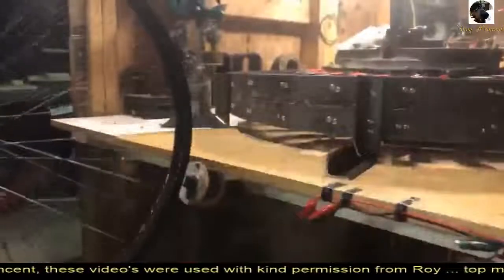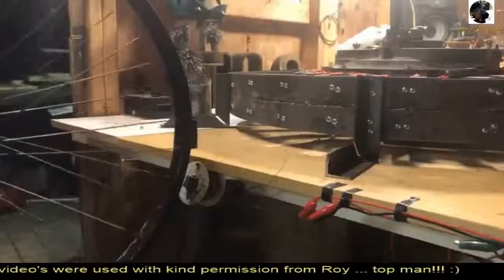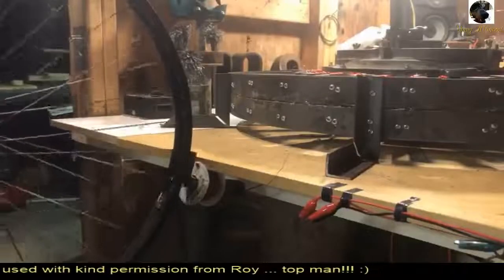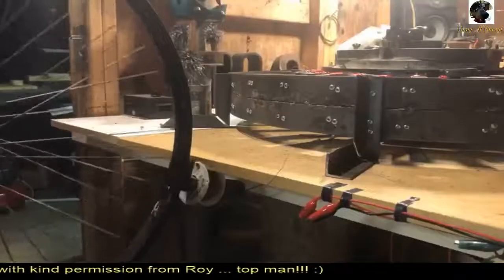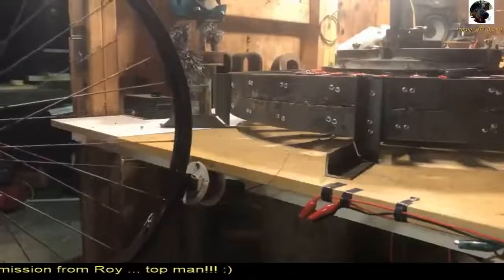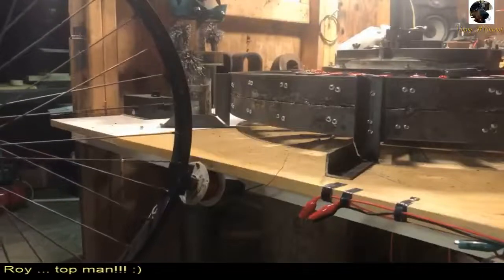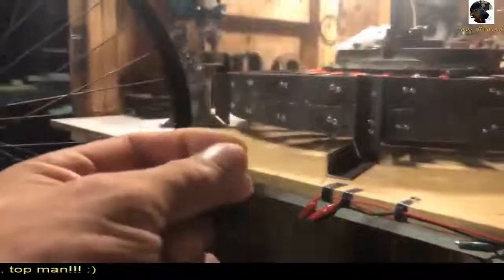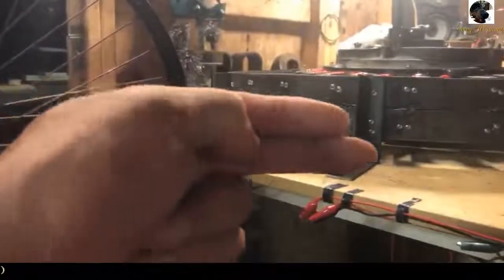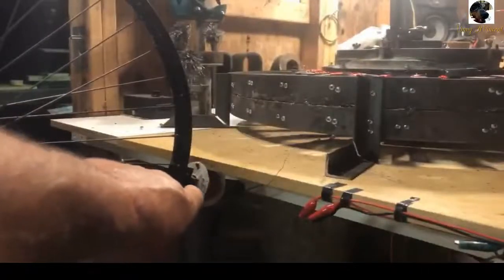That separation is creating the current that goes into the transistor, therefore turns on the transistor as a switch. But this transistor is not actually just a switch. It's what I call a linear switch, meaning that it'll switch on, and when it switches off, it's linear, meaning that it stretches out the field still, because the magnetic induction is still induced in that field that's half of a tank circuit.